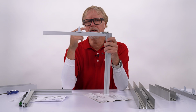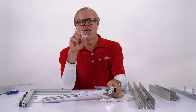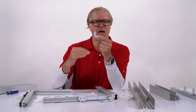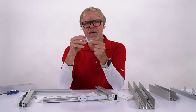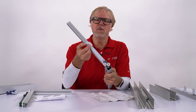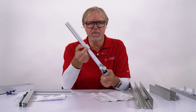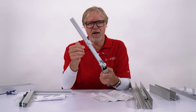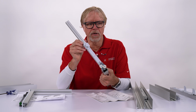Another key benefit of the new design, remember you used to trim this trigger in different locations depending upon how high the door was adjusted. In the new design you do not have to do that. So you can see on the triggers there are no indications or die lines for where you would need to trim that. This part does not need to be modified regardless of how high or how low you adjust that door for its travel. Okay?